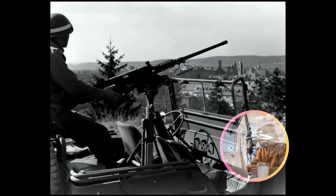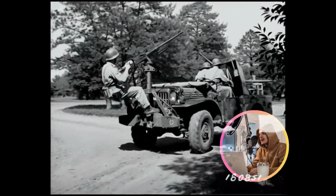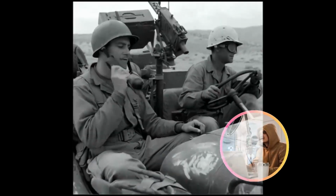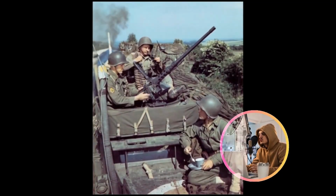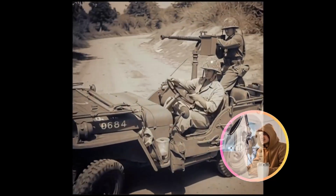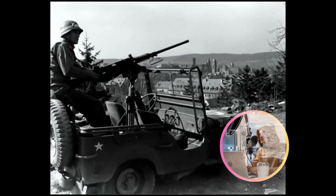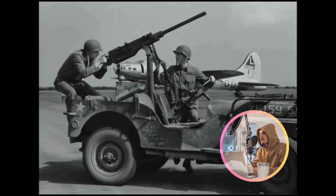These ranged from readily available aircraft landing gear components and robust 105mm howitzer recoil assemblies to, remarkably, even doubled-up bed frame springs. In situations where a qualified welder might be absent, the manual offered detailed brazing instructions, leveraging equipment commonly found in virtually any motor pool. Similarly, the specified steel pipe sections could be flexibly substituted with angle iron, square tubing, or, in dire necessity, even hard wood. However, the manual prudently cautioned that wooden mounts would necessitate replacement approximately every 6 weeks, due to the inevitable development of stress fractures.